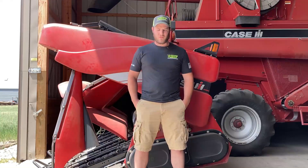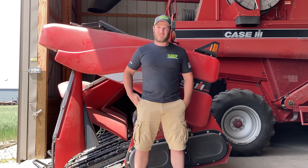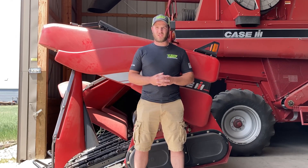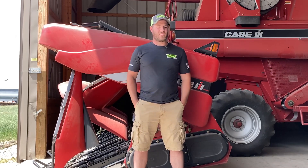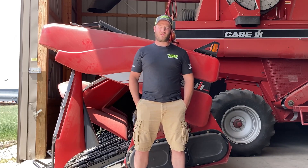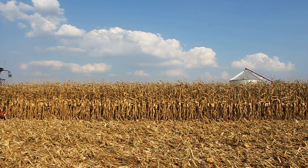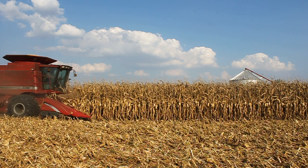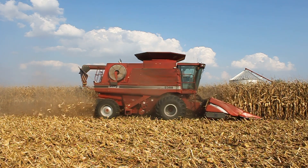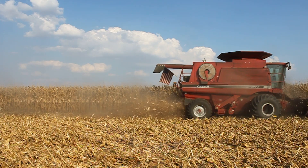We did bring in more material, but part of that was due to the year and the crop conditions we had. We spray fungicide on everything so our plants were pretty much 100% intact when harvesting. We brought in more leaf and a little more stalk, but it gave us the opportunity to capture all of the kernels and all of the corn on that plant. We fine-tuned some settings on the combine to accommodate for that extra trash, and at the end of the day we really didn't have very many kernels on the ground — you could hold in one hand the amount of kernels we had on the ground versus before.